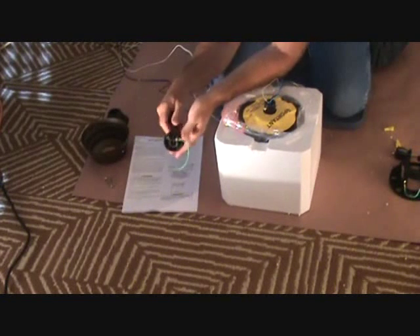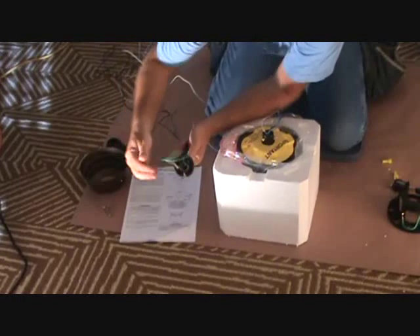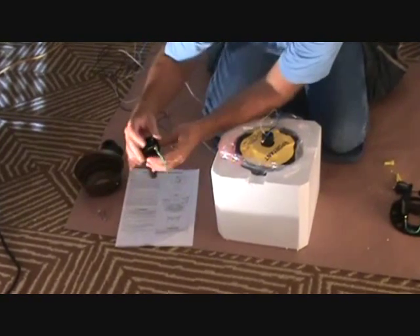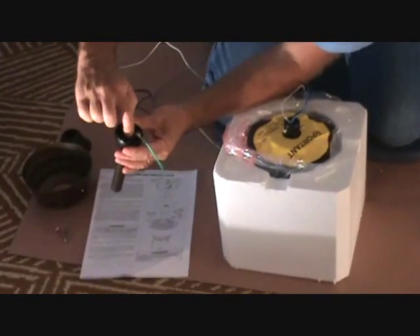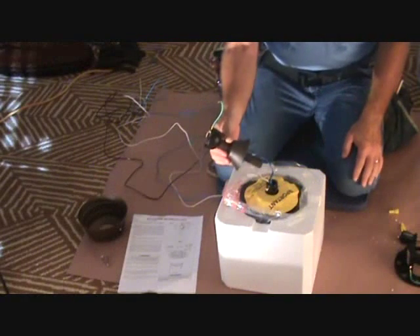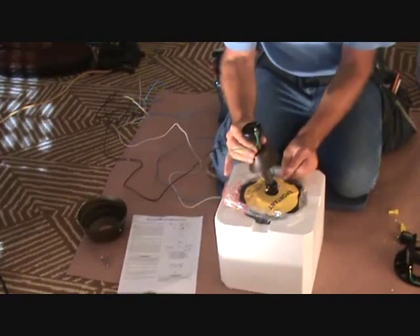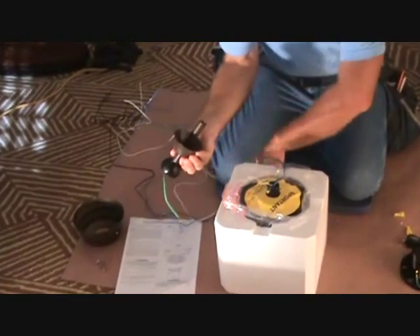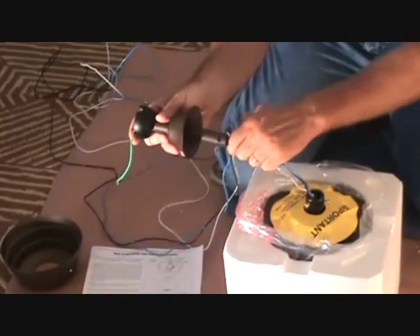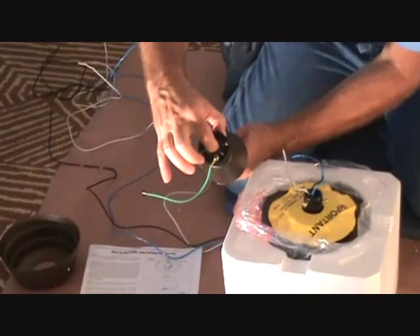There's a screw on the backside where this knuckle is. Here's your ground wire - just pull that out of the way for later. There's a little set screw on the side that keeps this knuckle attached to this rod, so we're going to loosen that up and pull it out. You're going to see there's a sliding pin in there - when you pull that out, the pin's going to slide out. If you have a long extension, say a four foot long extension, you want to slide the wires through there - they recommend taking the screw out with this pin so your wires slide up easier.